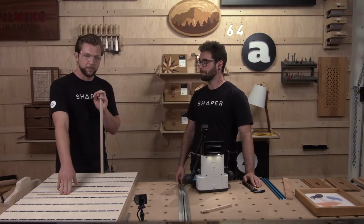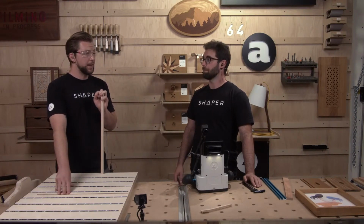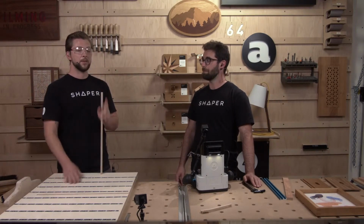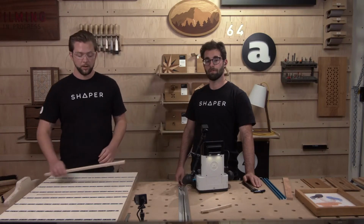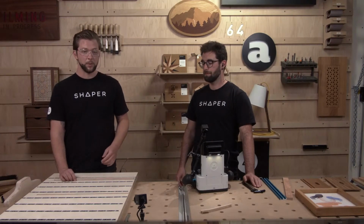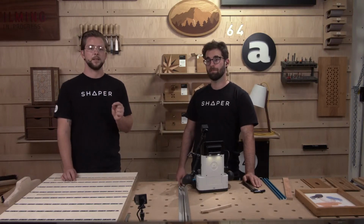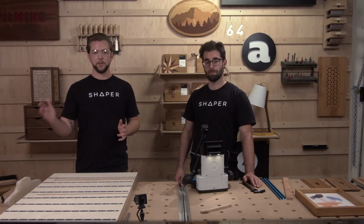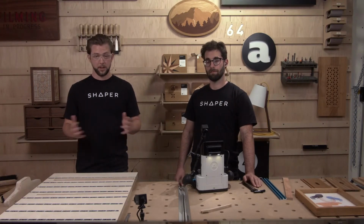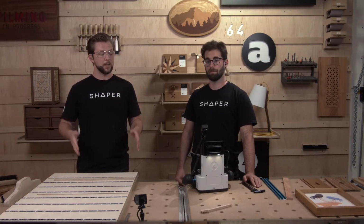I only cut one of these here. Now, in the first one we did, we cut both, and we found that even though the file itself is set up for a saw stop, our two dados were ever so slightly off, and our rails weren't fitting. But it dawned on me there might be slight changes from brand to brand, or from saw to saw, and how far those rails or those slots are apart.